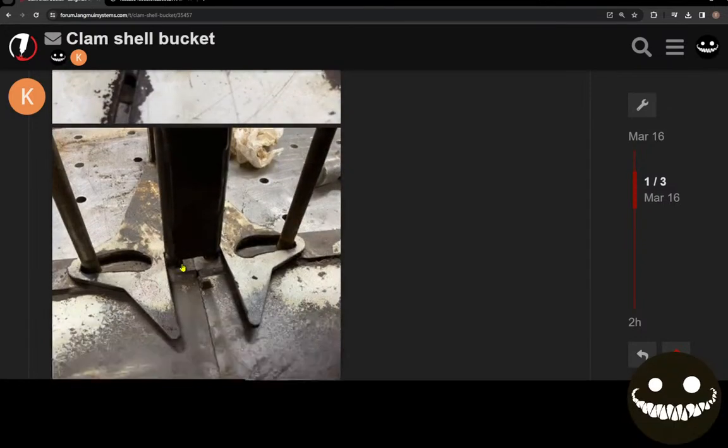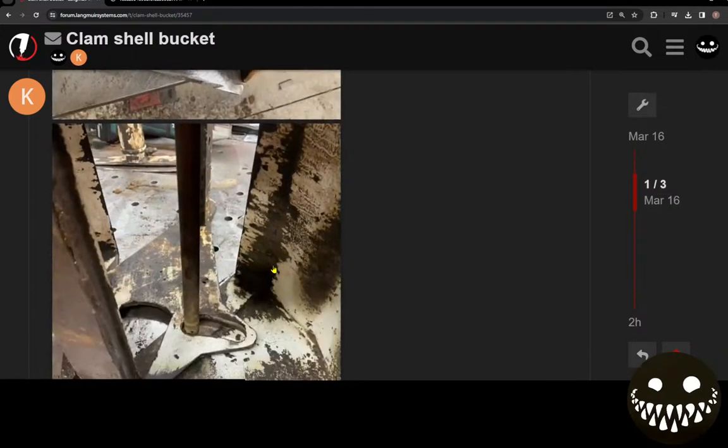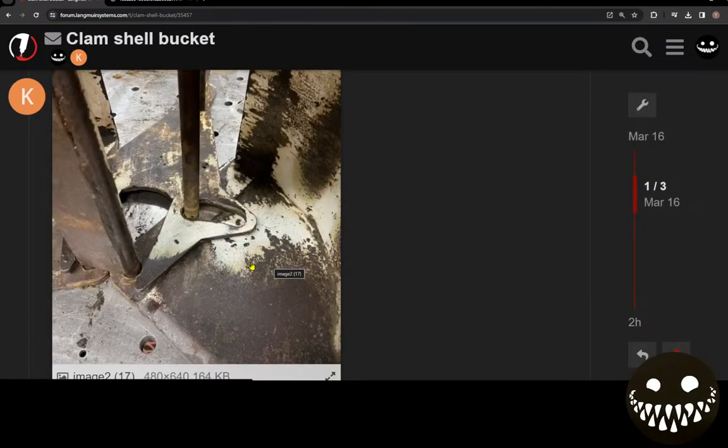Here's a good shot showing the pin - as this moves up, this pin travels in this direction. Let's remake this in Fusion 360 and we can kind of prove this slot in our repair piece, because it's worn out pretty bad in the actual piece. Proving the geometry correct is kind of important because you don't want it binding up - it'll just rub whatever's the least hard down.